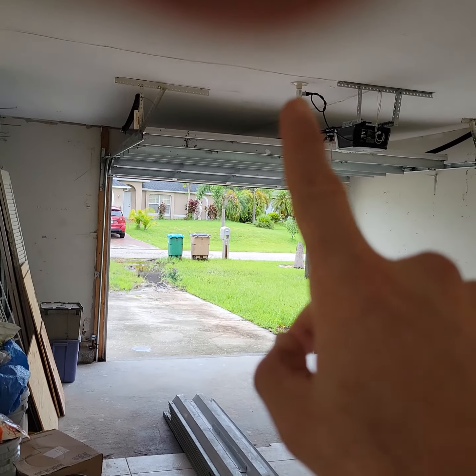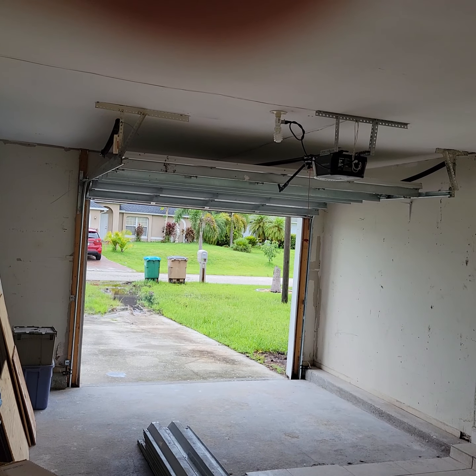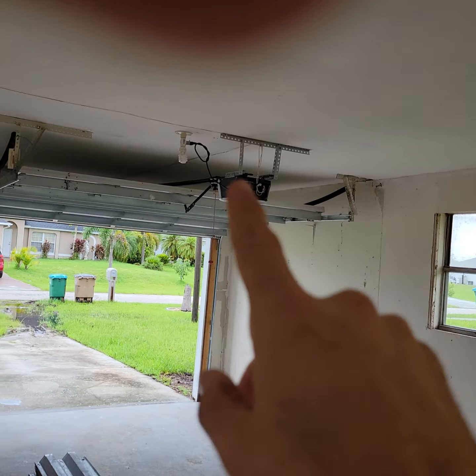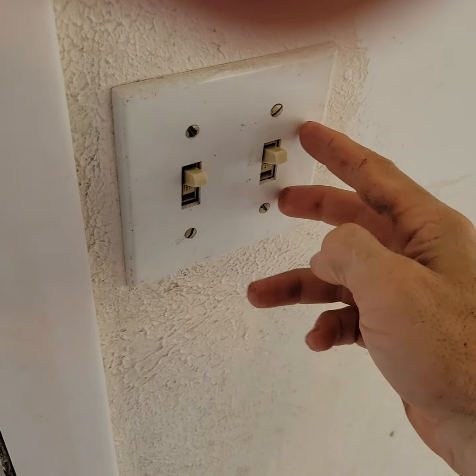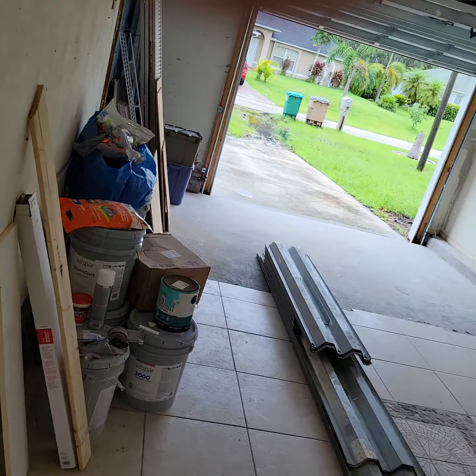That light bulb is not working, so we want to put a light bulb in there — or just remove that light bulb. We have one here and there's one on the opener itself. Just remove that light bulb, make this closed, then get a single switch plate, mud that — because we don't want that on a switch anymore.